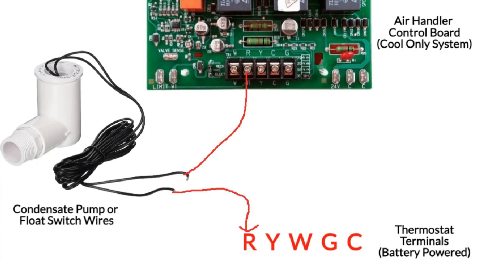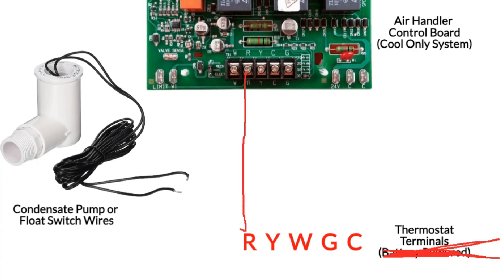But there are some circumstances in which this is not really ideal. One of those circumstances is when we have a smart thermostat. With a smart thermostat, we have 24 volts going up to our R terminal and a common wire coming back to the control board — and this is our charging circuit. Now if we were to cut off the 24 volts to the R terminal on a water condition with our float switch, we're not just disabling the thermostat's ability to run the cooling system — we are also disabling the thermostat's ability to charge its battery.